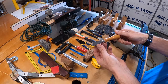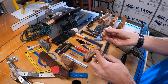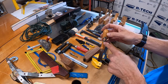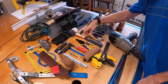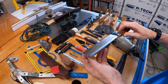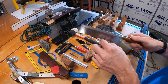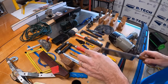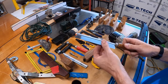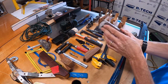Look at this — Two Cherries. This is a carving knife, though I'd call it a marking knife. Two Cherries is a nice brand; on eBay these run anywhere from fifty to a hundred dollars just for that one tool. And this razor saw — I can't quite figure out who makes it, but I used it to cut molding at the job site and it cuts so nicely. It's super sharp, super fine, leaves almost no kerf, and has a really rigid blade.